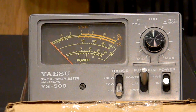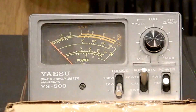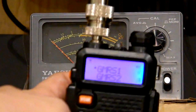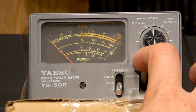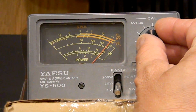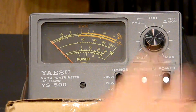We're using GMRS channel 5 on the repeater side, so you can listen in on GMRS channel 5 if you wish. We're going to be on GMRS channel 1 right now. GMRS channel 1 is the top frequency here, and we're going to calibrate first — there's a calibration knob we adjust so the meter needle is correct. That's calibrated, then we move it to power.